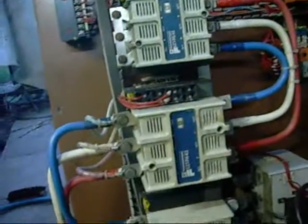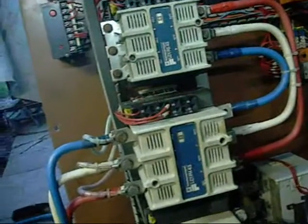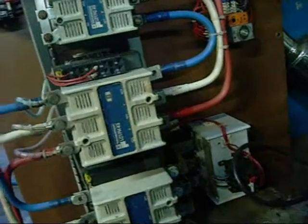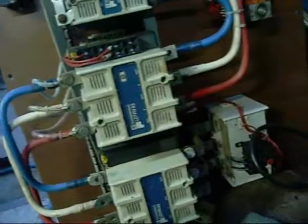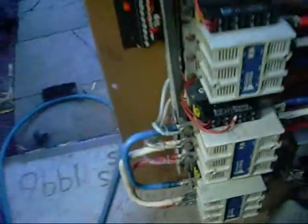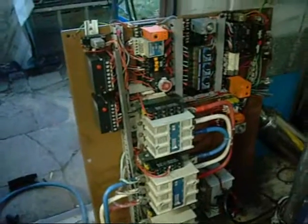It's a rather interesting little system — both of these contactors must close at once, or perhaps this one closes first; I haven't quite worked it out yet. But that's probably for the high power compression cycle, and it will change mode to run unloaded — an unloader valve will open on the compressor pump and just let the motor idle at low power rather than actually stopping and restarting it when air pressure drops. It's very inefficient to stop and start such a big motor, and it will also burn the motor out in the long term. You can only do so many starts per day of a motor rated at 250 horsepower.